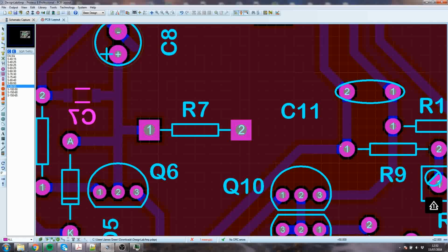in such a way that some of the photosensitive material is degraded by the UV and other parts are not, and then you develop it in a developer, and then you etch the board, and the bits which are undeveloped will not be affected by the etchant by virtue of them being protected by the photosensitive material which was not exposed, and what's left behind is just the tracks. And the bits that were exposed are the bits where the developer has developed the photosensitive material to the point where it's no longer effective because it's had the UV exposed on it, and then of course the etchant removes the copper and leaves you with just the tracks. So in that sense, all the pads and all the tracks and everything else, the copper is glued to the board, because initially the copper is glued to the board when it's one whole sheet.